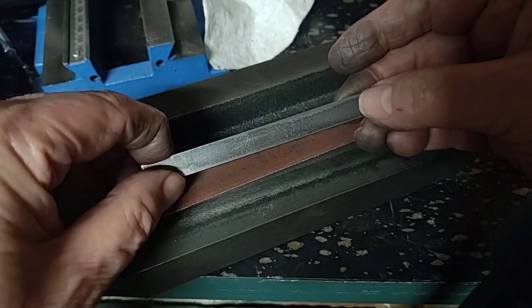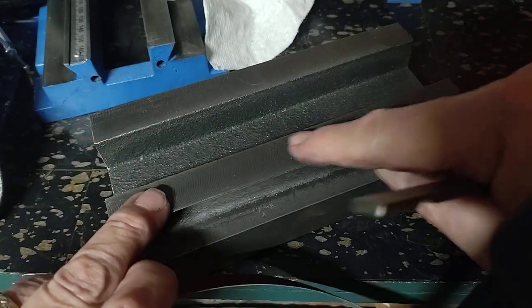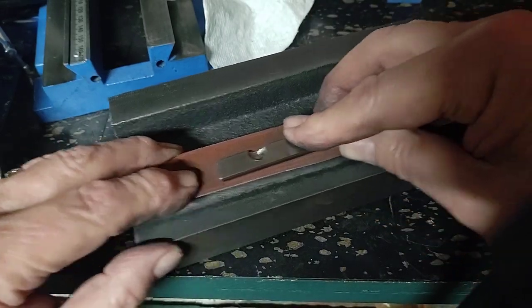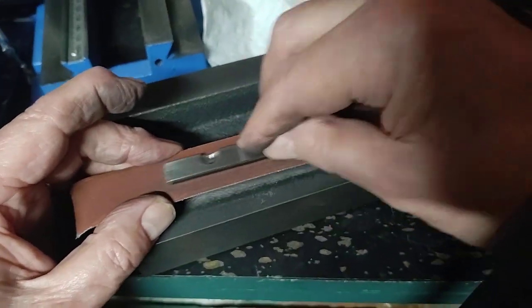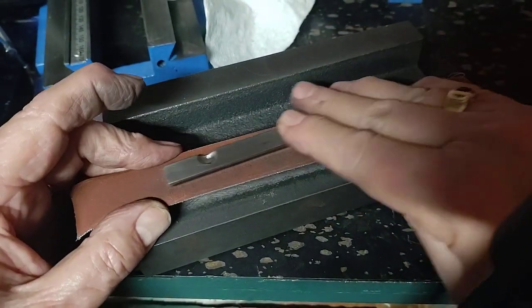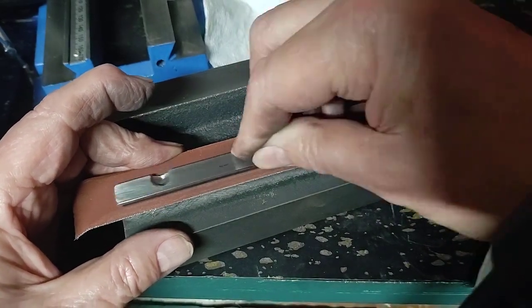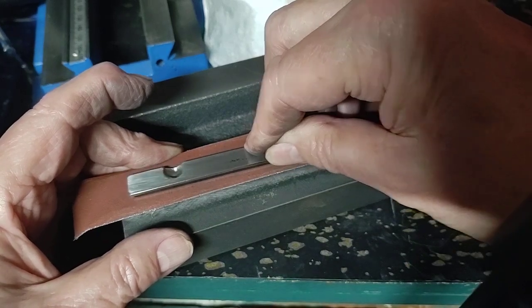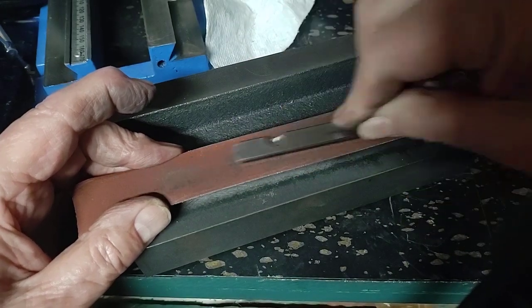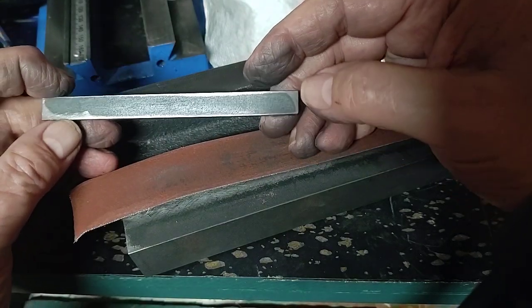This is the side that has to be smooth and slick. I'm using the bottom of this because it's at least reasonably flat. I don't have a surface plate or anything like that to work with, and this gives me a place to grind and smooth on. Sorry about the joggling camera — the camera's here, and so is the shadow lighting. The process here is just to rub it back and forth and work on taking the high spots off.